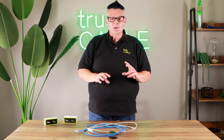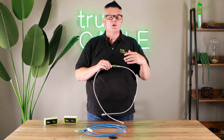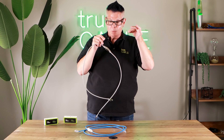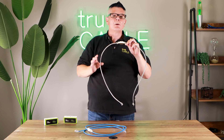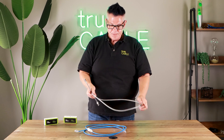I would recommend keeping your use of couplers down and getting longer patch cords that are the right length when you get an opportunity. You should use factory pre-terminated, tested patch cords with them. One other consideration around couplers, especially if you're terminating solid copper ethernet meant for permanent installation: if you attach RJ45 plugs by hand to your ethernet cable on each end and then join them with a coupler, each hand-terminated RJ45 plug can induce additional errors and issues into your overall channel. So not only do you have a potential problem at the coupler itself, but also at each hand-terminated end — tripling your possibility of problems. Factory pre-terminated, pre-tested cords when using couplers is the best practice.